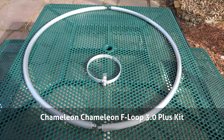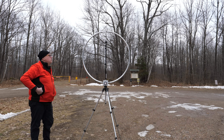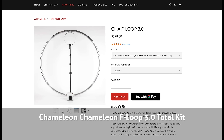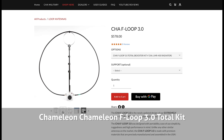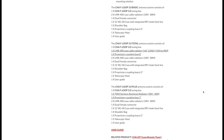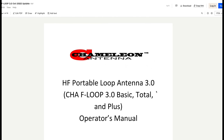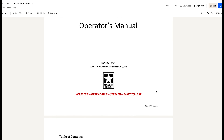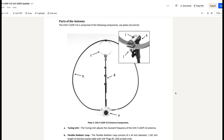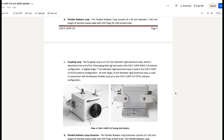The Plus kit contains all basic kit items plus two additional pieces: a two-section aluminum radiator for 10 through 40 meter operation and a larger 7-inch coupling loop. The F-Loop Total kit swaps out the aluminum radiator for a longer 146-inch piece of LMR400 and an 8-inch coupling loop, which is supposed to give better performance especially on 15 through 40 meters. All three kits come with an extensive user guide full of assembly and operation information — I encourage you to study it before attempting to use the F-Loop, as it will mean the difference between success or not.